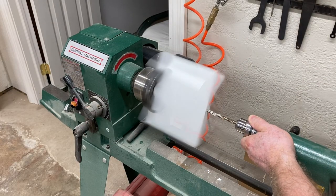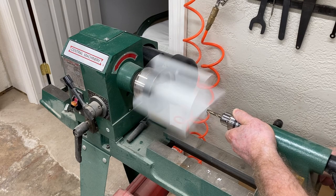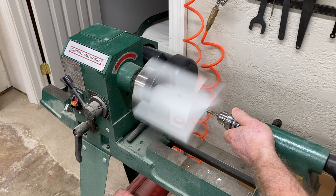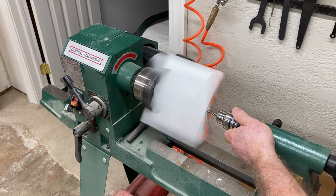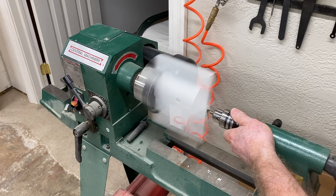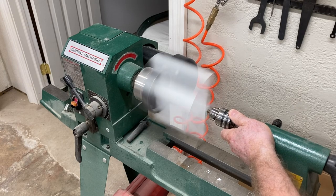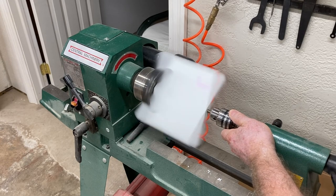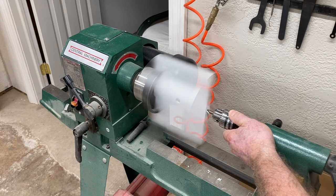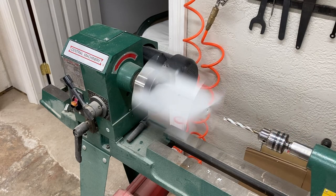I turned the camera around so that you can see the other side. I want to show you the actual drilling of this hole through the center of this PVC. It's really a very simple concept. You just have to be very careful since that PVC board is flying around in the air, and it's not a round circle. You do not want to get your hands in the way of that at all. So make sure that you stay way away. And if you feel that this is not a safe operation for you and your shop, don't do it. Figure out a different way to be able to drill this hole.